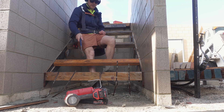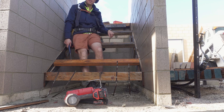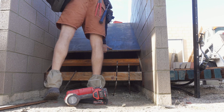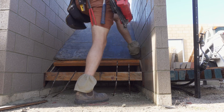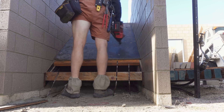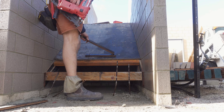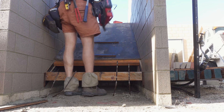So now I can put my ply on. If you are worried, you can put another timber down the center and just some uprights. Let's chuck the ply on. Now I put some cleats on — this is just to walk up. Be sure to leave the nails out so that steel fixers can pull the nails out.